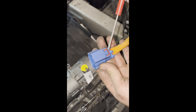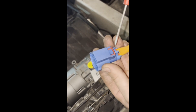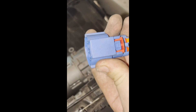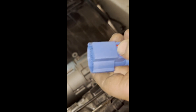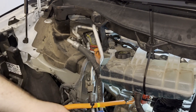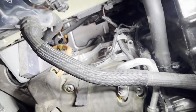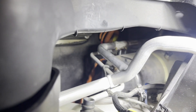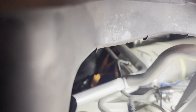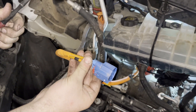So this is our new compressor and we're analyzing it to show you how the connector works. There's a little lock here — this red part is the locker. When it's out like this you should be able to use your finger; notice this little tab right here will move. When the tab is closed it does not move. Be careful — this is high voltage, so everything's insulated, but just make sure it's in service mode before you start. The wires coming out of the compressor go all the way back and wrap up into there.